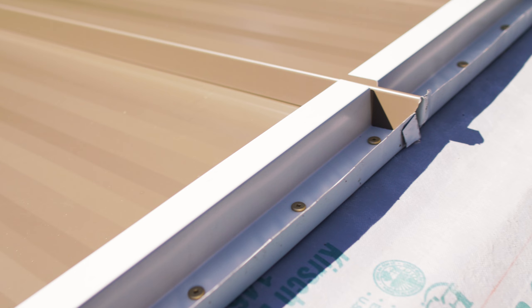If you're working on a house, there may be a reason to start at the back. Get a roof plan — know what the roof system is and what the details are. That drives your product base: what you're going to need for the assembly — the panels, the clips, the screws — all of those things need to align. Make sure you're using the right panel system with the right pitch, and that all your accessories, including the right clip, are in order.